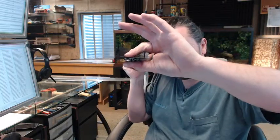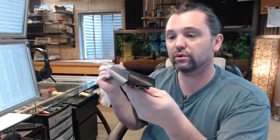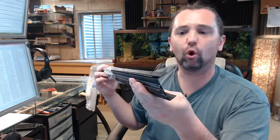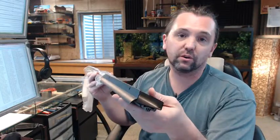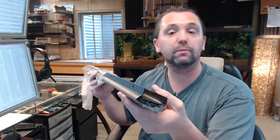The most critical dimension is to make sure you can fit the half inch material in here underneath your door, so definitely be sure to measure that along with the door thickness — inch and three quarter only — before ordering it. National Guard is a full line manufacturer of all things weather stripping related, not only something very typical like this door bottom with a drip cap, but thresholds, gasketing, material made of aluminum like this, stainless steel, architectural bronze based materials, and they even have a full line of steel vision frames and louvers for use in wood and metal doors.